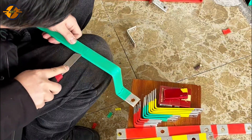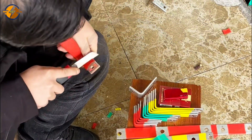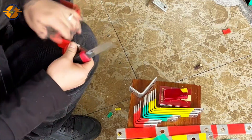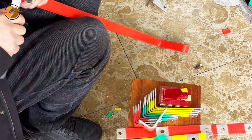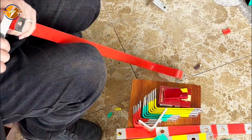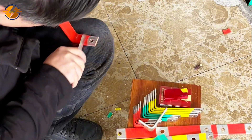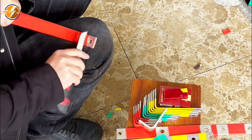The copper bars are wrapped in insulation tubes according to each color, helping us to identify each phase to avoid dangerous confusion. The first thing we do is wrap the copper bar with insulation and cut it out to reveal the drilled holes, which we will connect to the MCCBs. We are using blue, yellow, and red colors corresponding to each phase of the three-phase electrical cabinet.